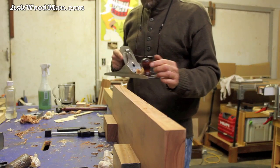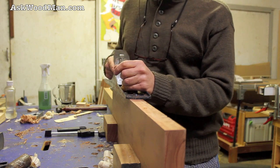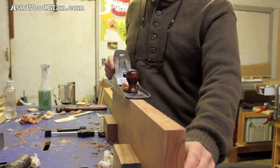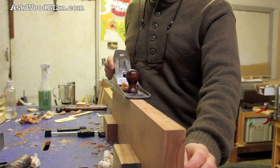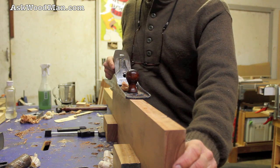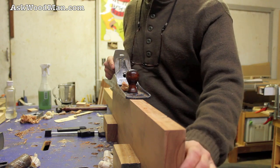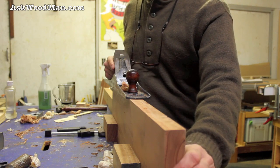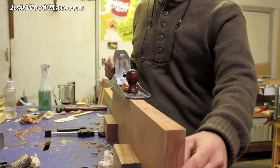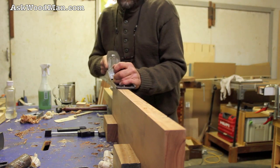I tried using my block plane on one of the staircases — you could see the edges of the stair treads, so I had to make sure that the edges were very beautiful and polished. I tried using my block plane and kept trying to sharpen and sharpen, but I could not get it to cut cleanly. So I had to use a belt sander very carefully to not overheat the edges, then hand sand with a series of sanding blocks to polish the edge before using my half sheet sander to get that final polished look on the edge, and it looked great.